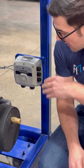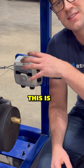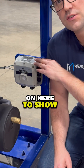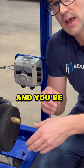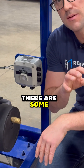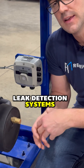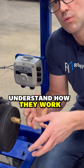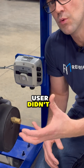This one here is an MRLDS-450. It can do a lot of different refrigerants. This is a CO2 trainer by Copeland, and they have it on here to show whether there is a potential leak in the system. You're going to see this depending on where you're at in the world — there are some regulations and rules where you may need leak detection systems. A lot of them I've seen in the field just turned off because people didn't understand how they work, or there were nuisance alarms because maybe the end user didn't want to fix it.